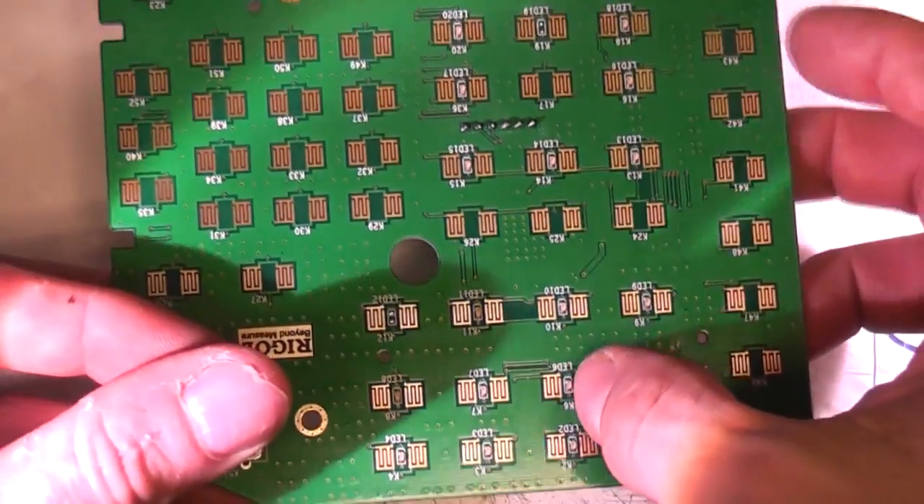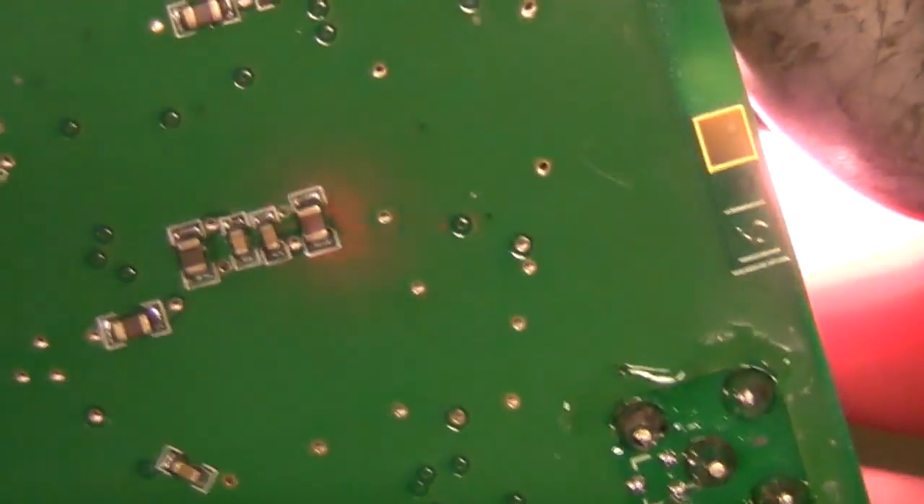There are a few blank areas with gold plating — these make contact with spring clips for EMC shielding. I do quite like these funky big long-reach BNCs. On the backside of the keyboard PCB there's a Lattice CPLD and its programming connector. From the layer markings here this is a 6-layer board, which is about what I was expecting — because they're using BGA chips you really need that many layers just to break the pins out from the FPGA.